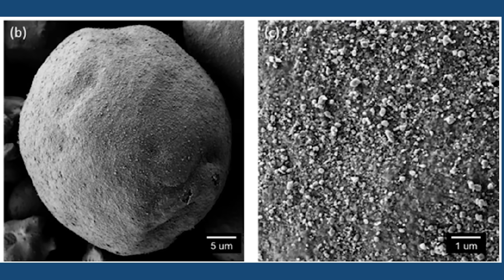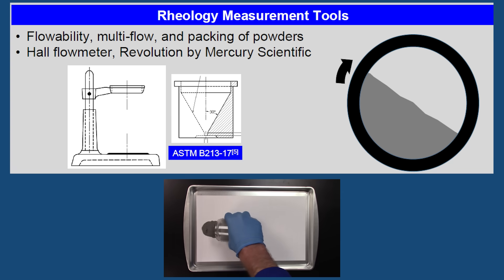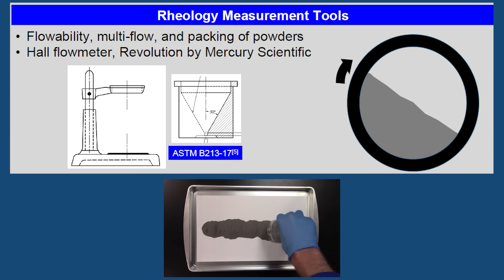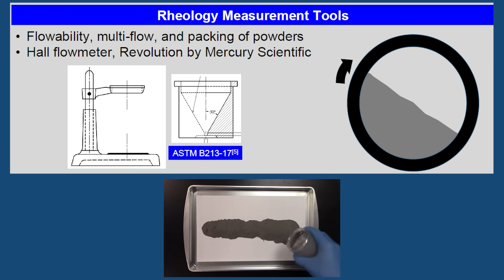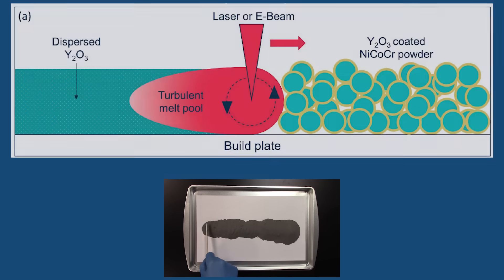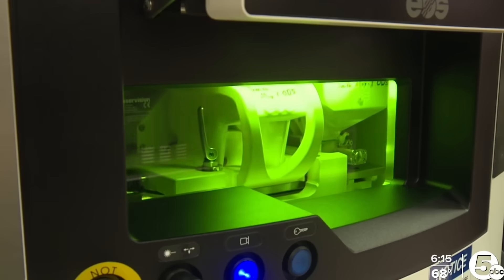What was really exciting was, one, it didn't deform the metallic powder — we still had very spherical powder after the coating step. And when we used hall flow tests to explore the flowability of both pre- and coated powders, we found that, at least qualitatively, it didn't appear to affect the flow of the powder at all. So we felt pretty confident we were going to be able to put it in the 3D printer and work with the coated powder.